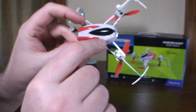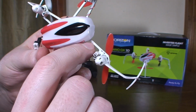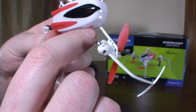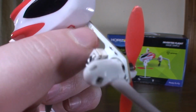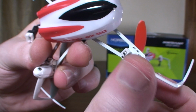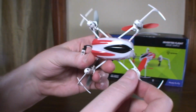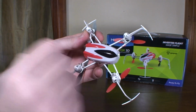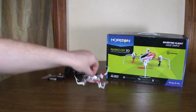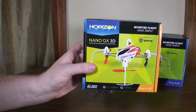So there is a video out there of a guy that has a pretty good fix for them. It does require soldering though, but basically he's just adding a little bit more solder to it. I think there's just not quite enough solder on them from the factory. So little crashes and bends just end up breaking the connection between the solder and the resistors or whatever they are. So you just got to add a little bit more solder and make a bigger, stronger connection there. Or you just do the solution that I did and just go out and buy a B&F version.